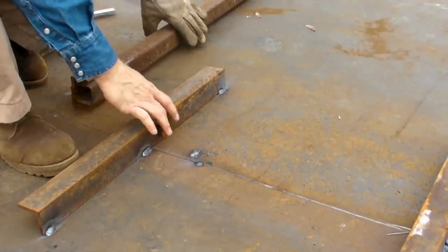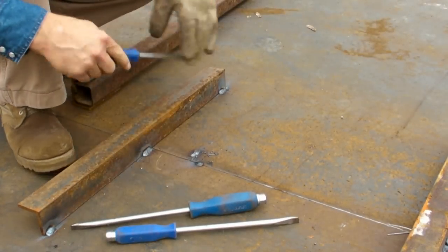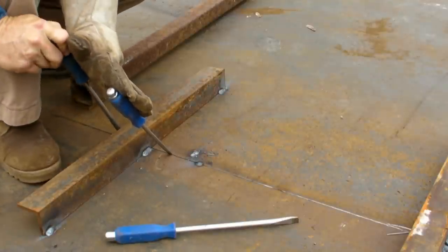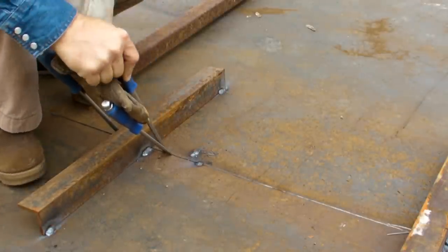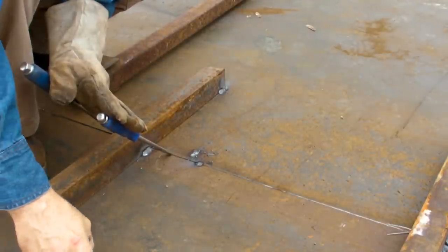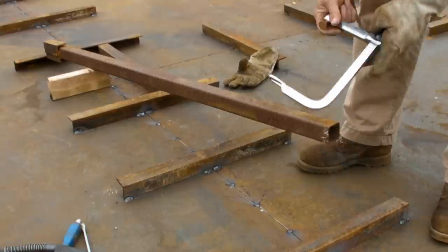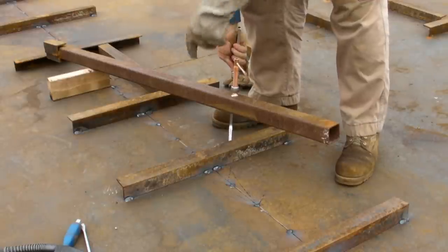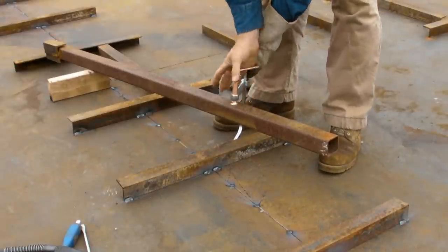I should have put that weld on while I had the angle welded on. But the other cheat is to use some big screwdrivers. As long as you've got an eighth inch of groove in here, you can actually pry this metal up a little bit — and a little bit's all we need. Just do it with screwdrivers you don't mind breaking the tips on, because you will break them. If you find one where you've got to put a lot of force on, use these F-clamps. This one came from Harbor Freight — it's about Harbor Freight quality, but it works. Hook it onto one of the other Strong Backs, push down, and you can probably just do that. If you need a little more force, you can use the clamp on it.